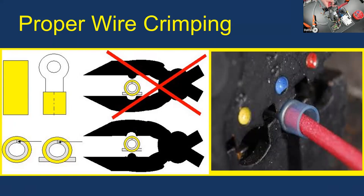The diagram also shows the proper way to crimp. If you crimp the wrong way, it doesn't push down enough to make a good clamp. The ears are designed to come down and crimp the wire tight. The key is not to crimp the insulation — crimp the wire. In past times we would crimp, peel the insulation off, solder it, and shrink tube it. You don't have to go to that degree, but if you want a truly robust robot, do it. If you're doubting yourself, you can solder it, shrink tube over it, and then put it on your robot.